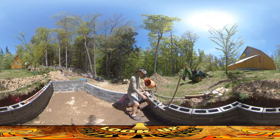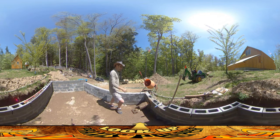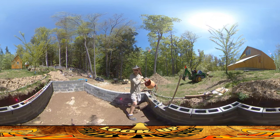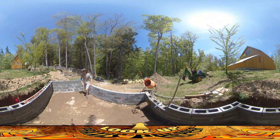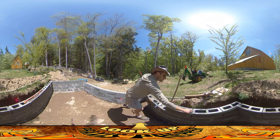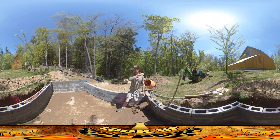So I'm going to start filling in the rest of these. Normally if I wasn't doing this for video, I would have filled them all in and then did this so I'm not getting in the way of myself — I wanted to demo the process for you guys. What I'm doing for today is just finish up filling these blocks with the concrete with the aggregate in it. Then tomorrow, once this layer I just set down is all set, I'm going to go in and fill all the gaps between it with the mortar mix. And then the day after that, we go up another level. I'm getting pretty sick of concrete. That's it, thanks for watching.